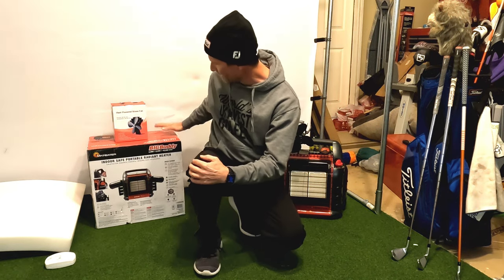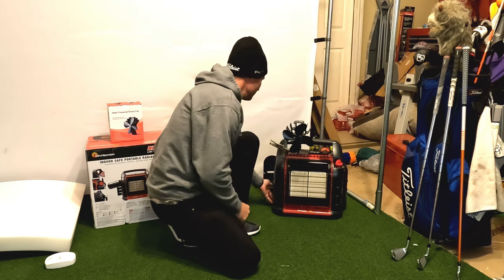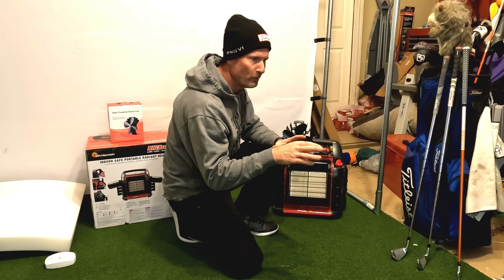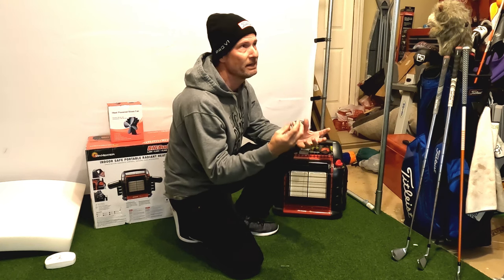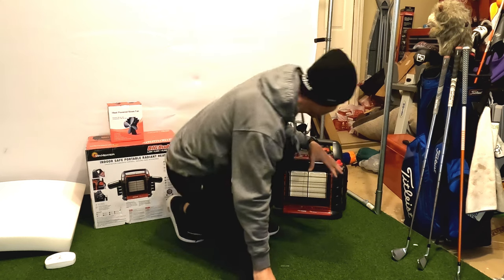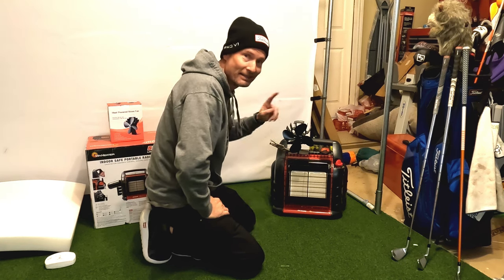So here's what I got — I picked up the Big Buddy. Mr. Heater produces a whole line of heaters that are indoor-safe and portable. They use the one-pound propane tanks, and this particular model has two tanks you can use — I'm only using one, mostly because they're all sold out. What this is is just a propane heater. You can actually attach a bigger propane bottle to it with a cable. The one I bought was a Mr. Heater cable and you have to have a filter with it. It says it's a high-pressure hose which releases oils, so I'm getting a different cable altogether. I'll have the link below on exactly what I bought.